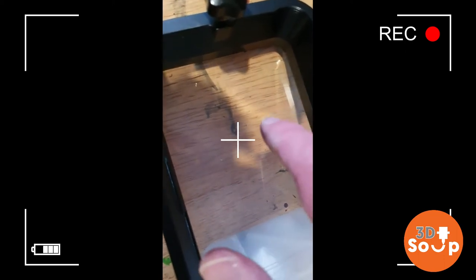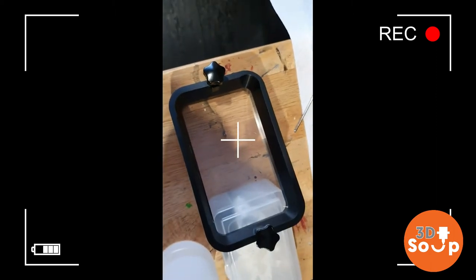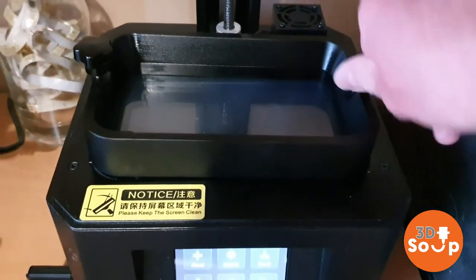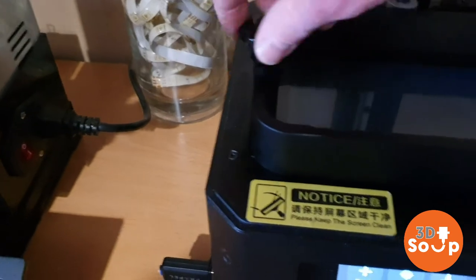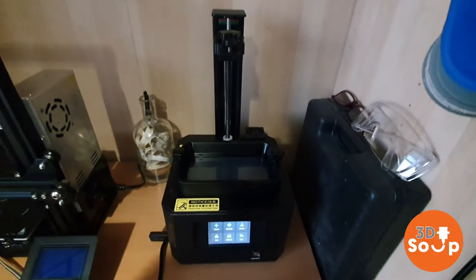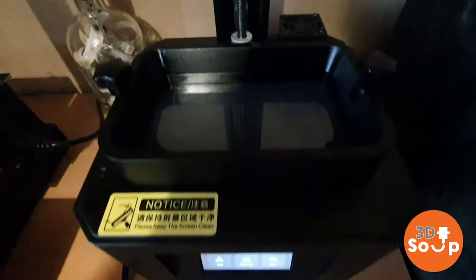Now that it's tight, you should get a noise like a drum. With the film firmly attached, you can now attach the reservoir back onto your 3D printer. Screw the handles in place, making sure you don't touch them on the mobile phone screen and making sure there's no dust or particulates between the film and the screen. I recommend a lint-free cloth just to make sure it's nice and clean. And there we go - that's an empty reservoir ready for me to put some more lovely UV resin straight in.